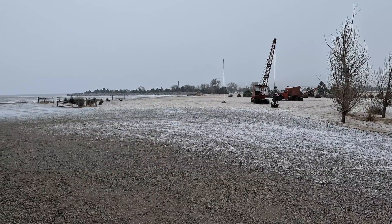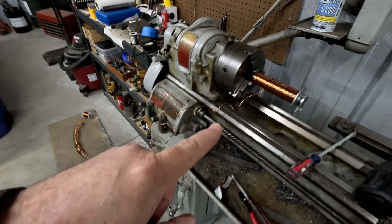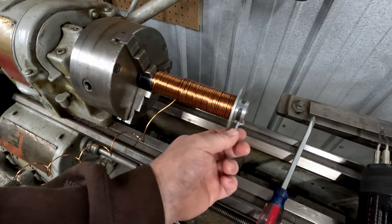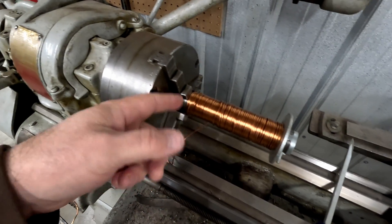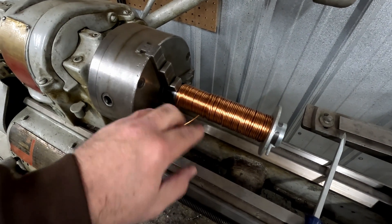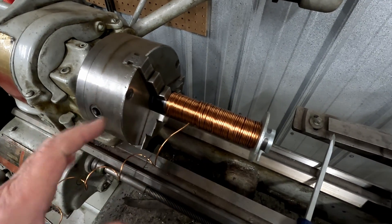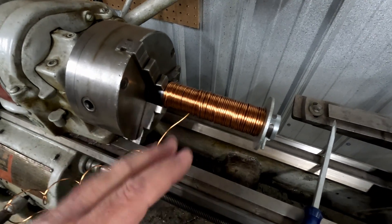Got a little dusting of snow last night — it's kind of cold. I got a bit frustrated yesterday trying to wind those coils on the lathe because every time I'd get to the end, they'd want to move off or spool a different direction. On the second winding, they'd want to wind in between the others. So I unwound it. What I'm going to do is wind it all the way to the top and then wrap it with electrical tape in between the layers — that'll keep the wires from going down in between the first row.